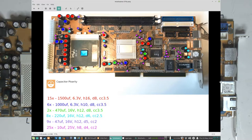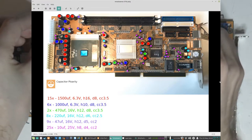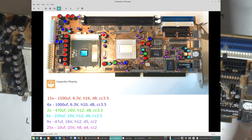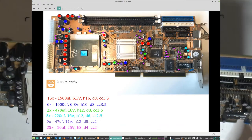You can also have a vertical orientation, so you can have, for example, east and south, if they have to. There are also boards where there is no real order, where there are exceptions. You should always pay attention to that. But on this particular board, I haven't found an exception to the rule. You could obviously also mark up the orientation, and I do have a marker telling me if white is negative or positive. That can also differ. So the white half of the circle on the PCB could be positive sometimes. That happens. In this case, it's negative, which is easy enough.